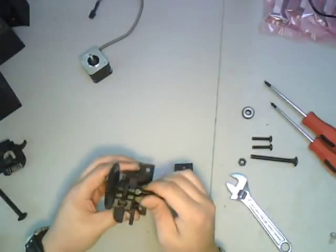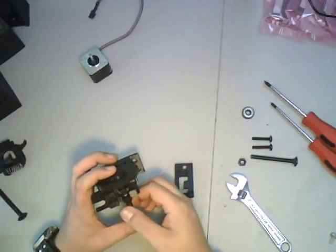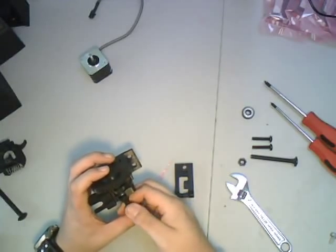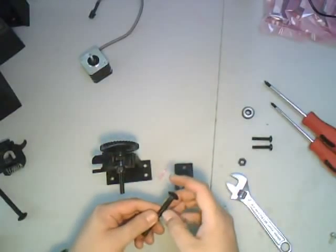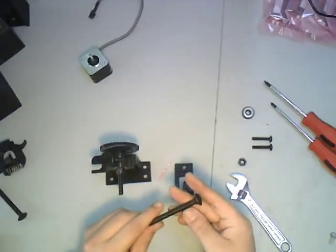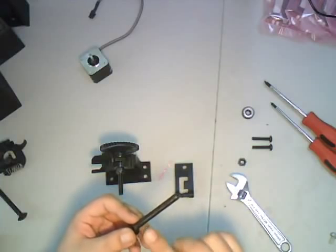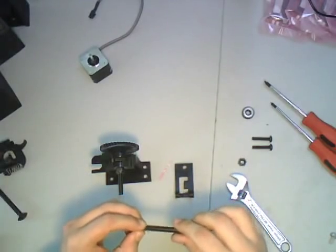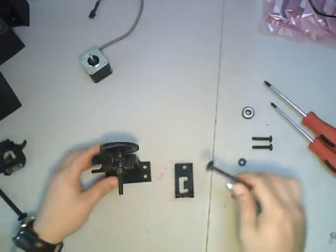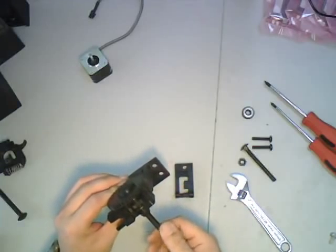If you've built any machines like this in the past, you know that most of these machines for this type of drive generally use a hob bolt — a bolt that's been run through with a grinder, die, or tap. We didn't like that idea. A lot of the time you see bolts shaved down to nothing, which causes a structural weakness. Plus, with it being modular, this knurled nut is an off-the-shelf piece you can just order instead of a hob bolt, and it still makes sense to have.